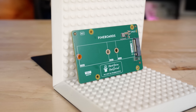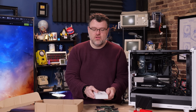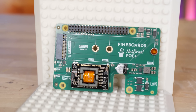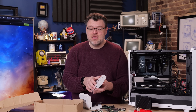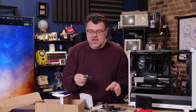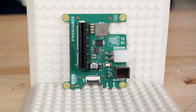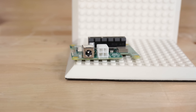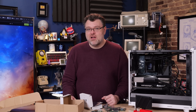The larger hat drive uses the same PCIe breakout connection but is much more appropriate for a 2280 drive, connected with the tiny fragile ribbon cable. There's also the Hat Drive PoE+ - a version of the hat that has PoE and an M.2 connector, still requiring the little ribbon connector. This is a lot of fun for augmenting a standard Raspberry Pi, not the compute module. And finally, if you're thinking you can turn the M.2 into a PCIe slot and do something creative - they're way ahead of you. May I present the Pineboards PCIe board, with a physical X4 slot that's open-ended, taking 12-volt input or a power supply.